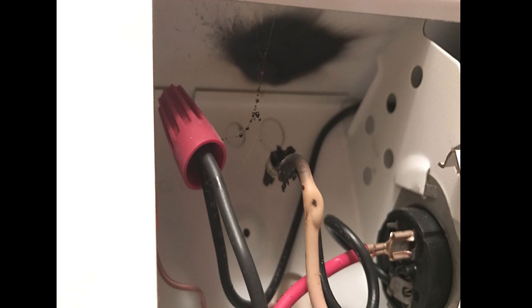Another thing that happens is say it's not two different ungrounded conductors — like two hots that end up touching each other — but say it's a hot and a piece of metal, like the actual metal enclosure that a light fixture is in. If that hot over time gets way too hot and that insulation starts to degrade, that conductor is going to touch the metal of the fixture once that insulation is gone.